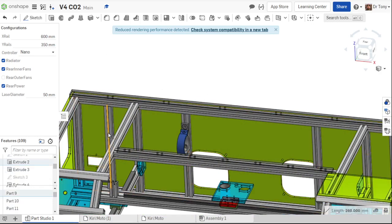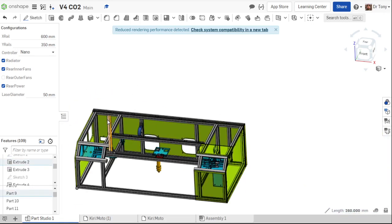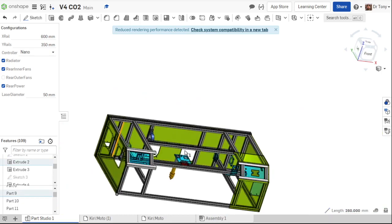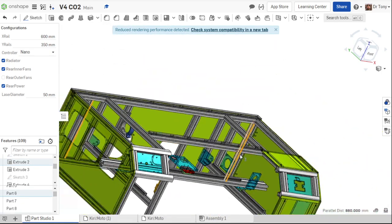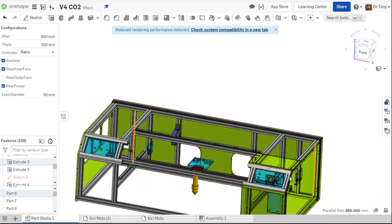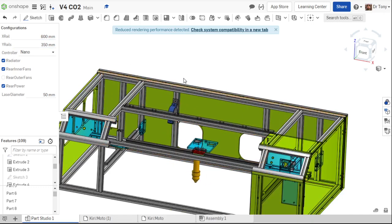The mirror that it hits, the first mirror that it hits will be on this rail. So that means we have about this point right here to about this point back here of distance to mount a tube, okay? Which is 880 millimeters. So I can fit a 50 watt tube. A 50-watt tube is 800 millimeters. 800 to 850, I guess they vary. A 40-watt tube is about 700 millimeters. So I could actually go smaller size and fit a 40-watt tube.